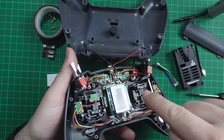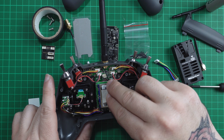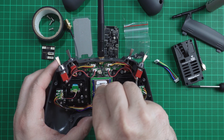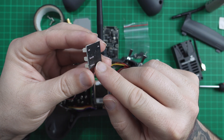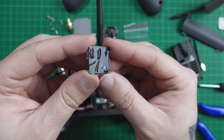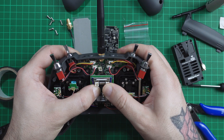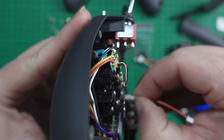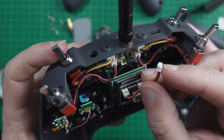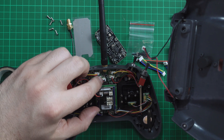Now be careful. Let's take this cable first — it comes from the battery. Then install the double-sided tape on this. I think this is an updated version because these pins on the board are a bit shorter here, but I will put some tape just in case. Now let's stick the board on the sticky tape and press gently. Use the red and black wires to connect the bat out from this board to the battery connector we removed earlier from the main board. This can only be inserted in a certain way, so take your time to make sure it is properly connected.